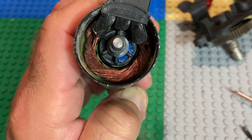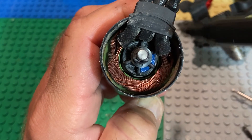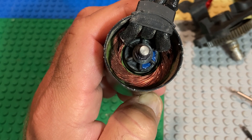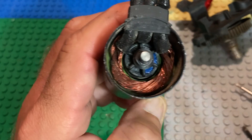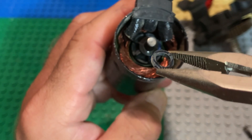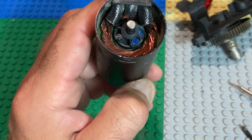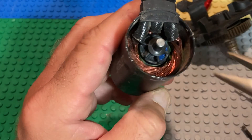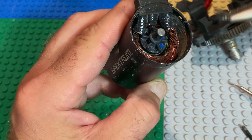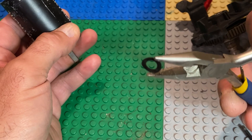This bearing is fine and I'll show you later in the video how to deal with it. The Philly BRC way — I try to make everything as simple as possible — so I'm just marking this with a Sharpie marker so there's no guessing when I reinstall it. We also have a spacer or shim, and this washer is concave in shape, so I put the concave, curved side down when reinstalling.